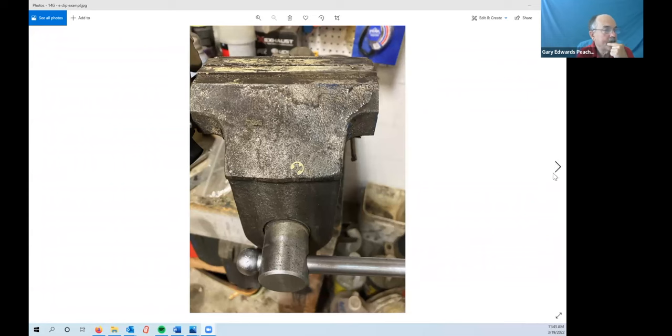Back to screen share — back to these hydraulic clips. I just took this one to show you what the hydraulic line clips look like; this is a roll bar cylinder, not one you'll typically be changing. Look closely at the clips before you remove them because you need to know when you've got them all the way back in. When Top Hydraulics sends these back to you, the seals are a little tighter so the lines can be a little difficult to get in. You can still lose clips with all your preparations — I was taking out the bottom end of a bow lock cylinder, had the magnet beside it, and despite that, it went ping and hit my shoulder. I started cleaning up with a magnet and got really frustrated — stood up, and there was the clip sitting on the vise.